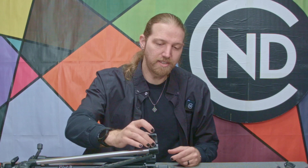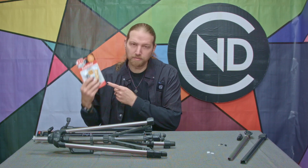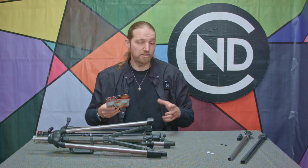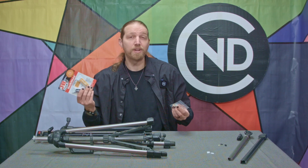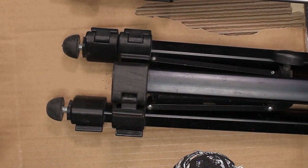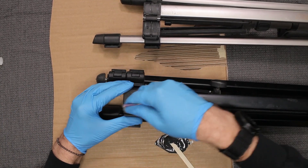The first thing I want to do is actually glue these latches permanently closed. My idea is to use a threaded insert, and having the extra plastic from this latch for the insert to go into will work better than just going into the thinner wall of the plastic underneath. To glue them shut, I'm going to use some quick-setting JB Weld epoxy. As I've said in the past, it's always hit or miss when you're gluing plastics. I'm also going to try to melt the threaded inserts into place, which should hopefully meld it all together. You want to rough up your surfaces before gluing — this provides more surface area for the glue to grip onto.